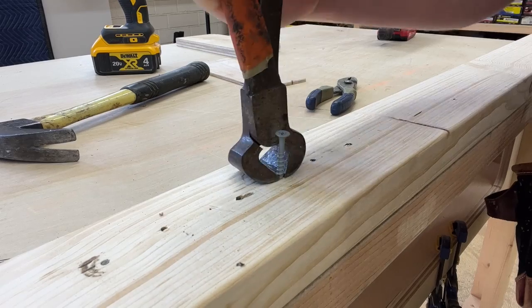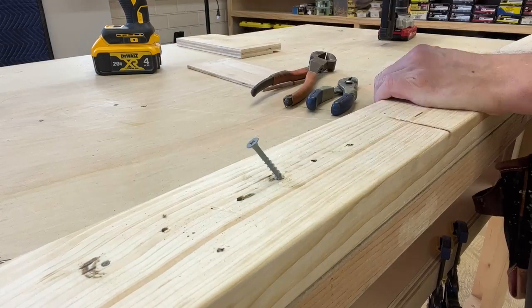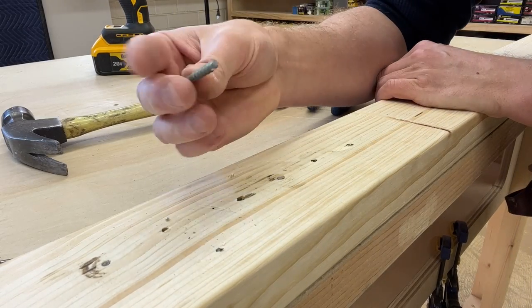That's what I'll do with screws that can't be backed out. You can't pry up screws — they have too much holding power. But if you notch them at the base a little, you can then break them flush and counter-sink them slightly.